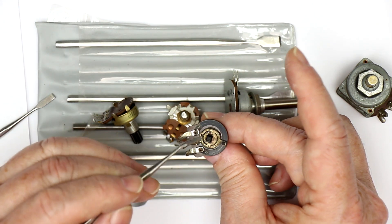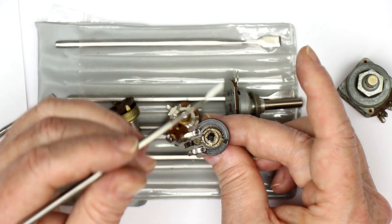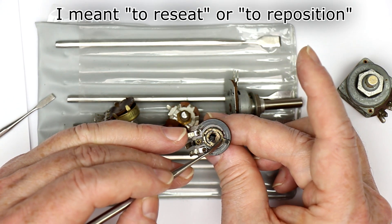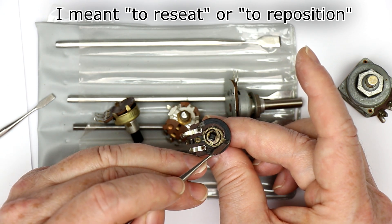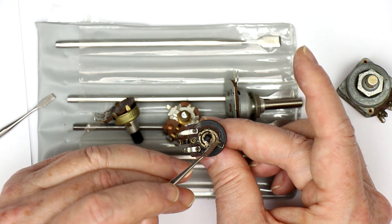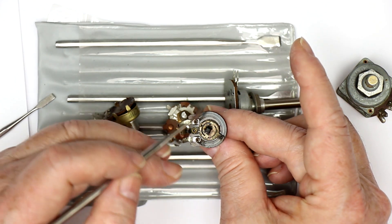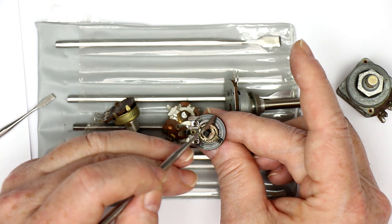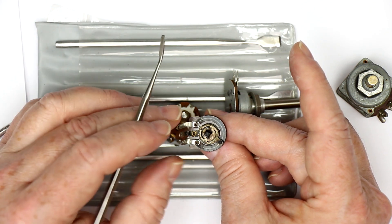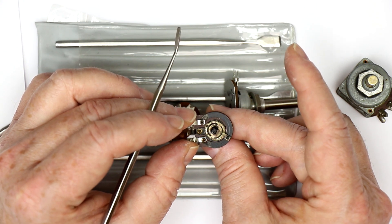There is still one last possibility. If nothing else works and you are really desperate to keep the original potentiometer, you might try to reset the little graphite mine which serves as the wiper — to reset it slightly to a different position, for example by angling it a bit so that it makes contact at another radius on the resistive layer. That might work, but this is of course the very last try before giving up.